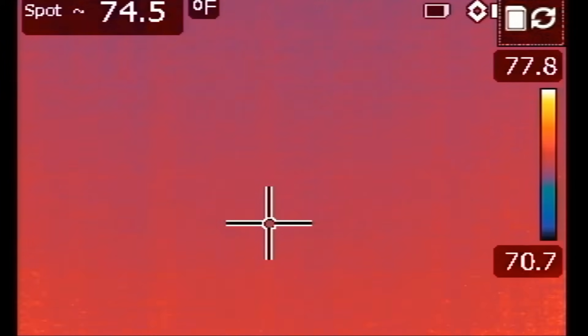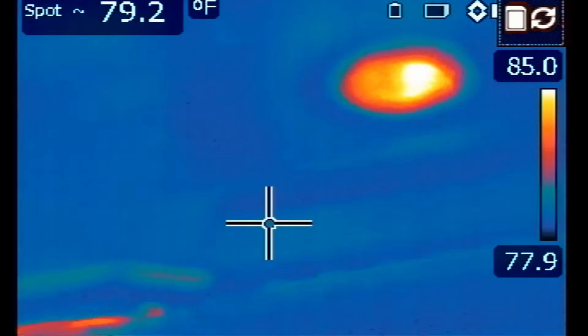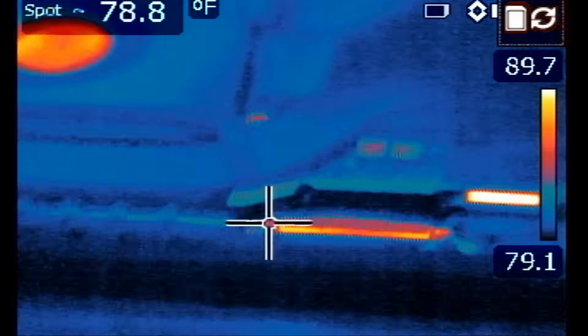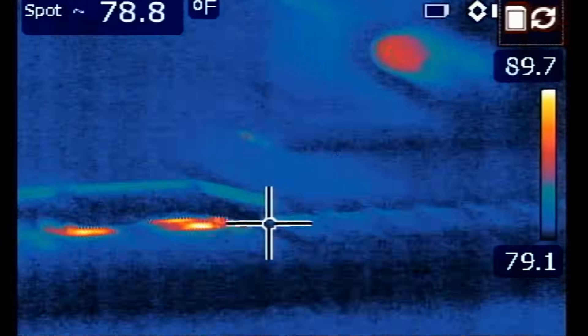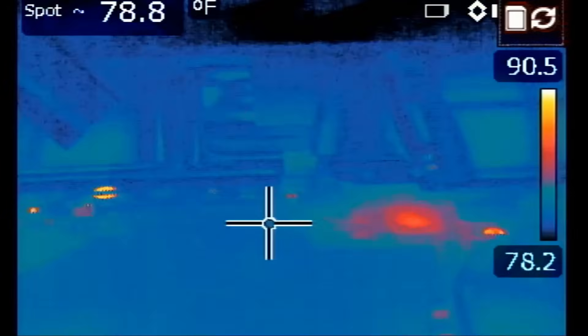So what's next? The next thing I want to do is inspect the board under a thermal camera, just to see if there's any signs of power — what's powering on, what's not powering on — and then we'll make a decision from there. Thermal camera on. I want to point it at the motherboard. We have one fan here, another fan right here, and that's the board. Let's plug in the charging cable — I just want to see if there's anything obvious. And the board looks cold.